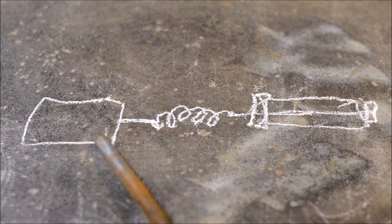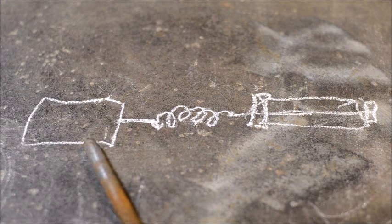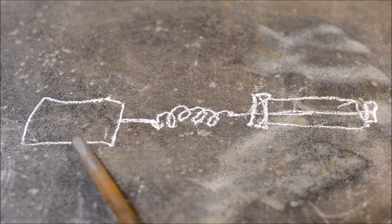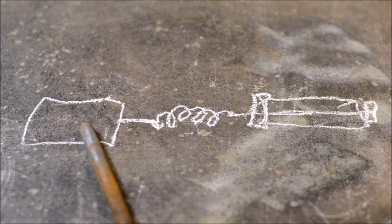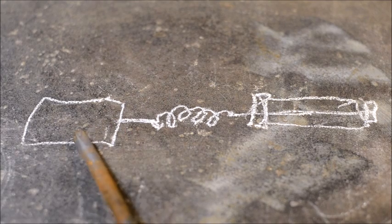This is going to be the struck end — the part that will go under the power hammer. This can take many forms: these can be fullers, butchers, set-down tools, any number of wildly imaginative tooling. We're going to do several different things — some will be punches, some will be fullers, some will be hot cuts and butchers, and all sorts of different crazy tooling.